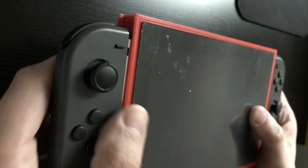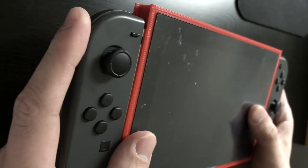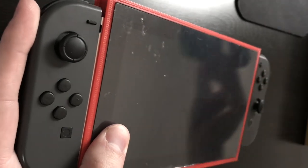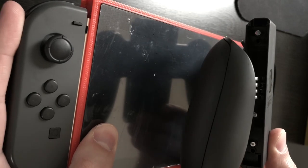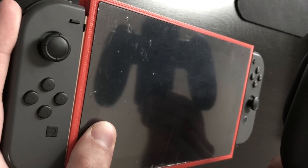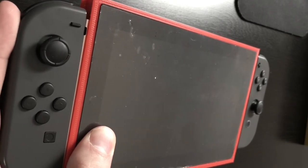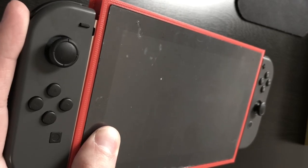On the sides we have some joy-con mounting features. I was going to be ambitious and try to design joy-con mounting features, but in the end I decided not to reinvent the wheel. The joy-con grips that you get with the Nintendo Switch actually have really good metal brackets that are easy to take off. It's easy to dimension the size of the bracket, and when you go to assemble everything it looks clean — it looks like a Nintendo Switch. You're guaranteed it will work with all the Nintendo joy-cons that you have, and it locks in place.